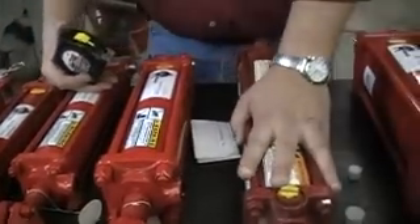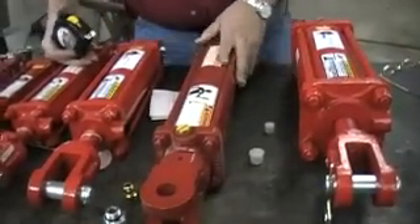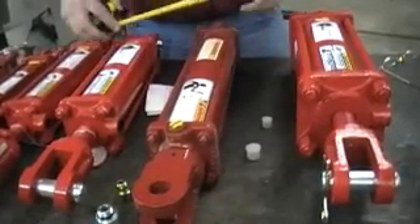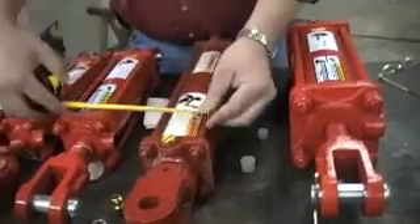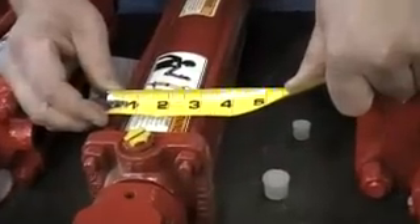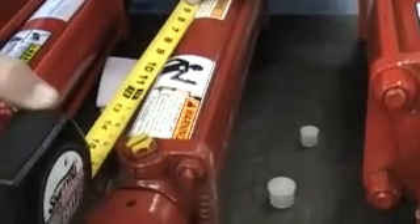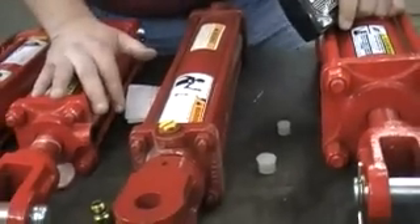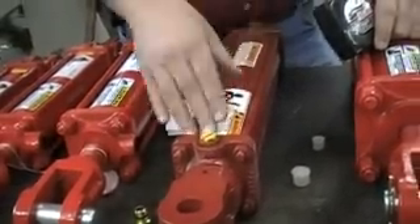This one is another brand — the Energy brand cylinder, another fine cylinder sold at Agri-Supply, made in Iowa. If we wanted to determine the size of it, we would start by measuring the outer part — we get three inches. Then we measure the barrel assembly and get 14. We deduct two inches from 14 and come up with a 12 inch stroke. So that's a three inch bore, 12 inch stroke cylinder.